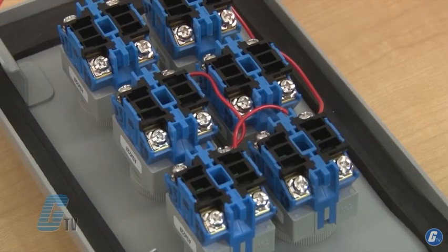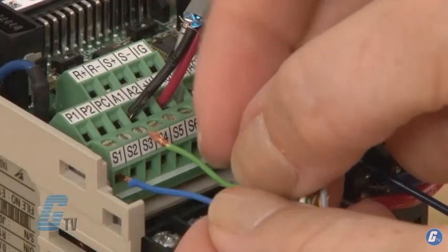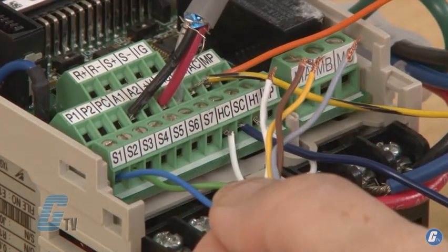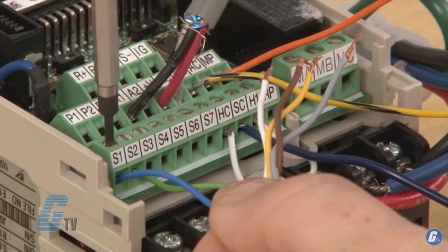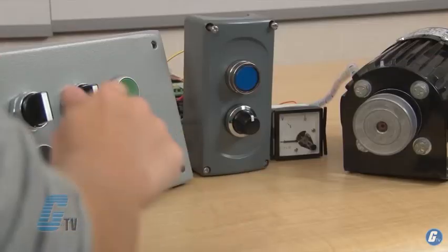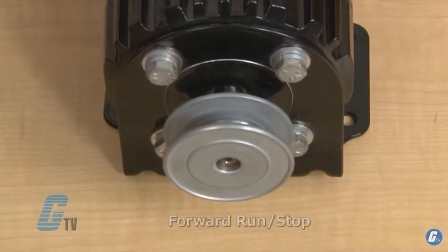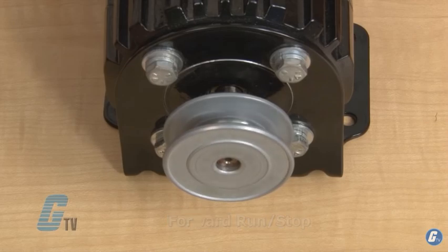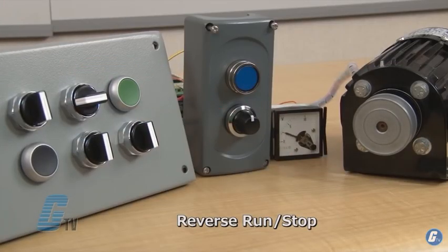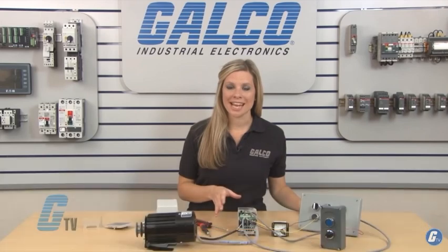You will notice that my contact blocks are jumped together. The other ends of the switches are to be wired to S1 through S7. S1 is for creating a forward run stop. S2 is for creating a reverse run stop. This will make forward and reversing two separate switches and must be maintained switches.